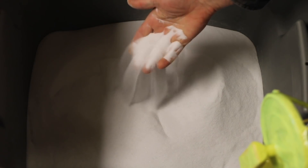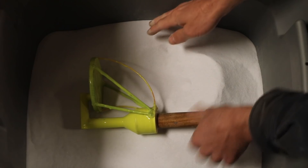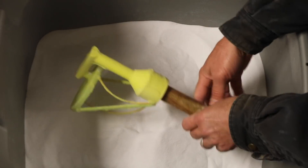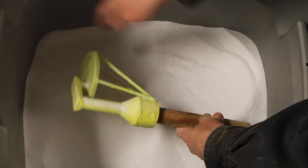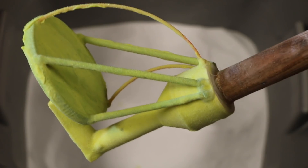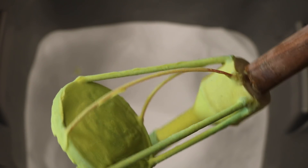The second coat and all subsequent coats will get a coating with silica sand. This is my fine grade, which is 50 to 100 mesh — that means the particle sizes are between 0.15 and 0.3 millimeters. You just want to coat all surfaces and then let that dry.